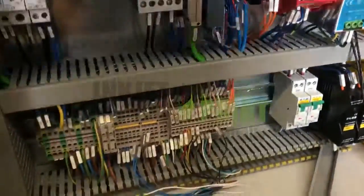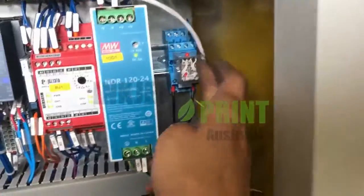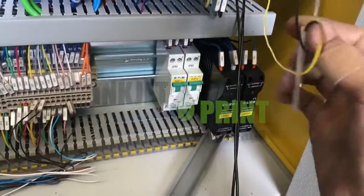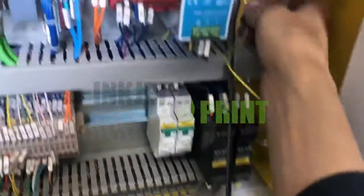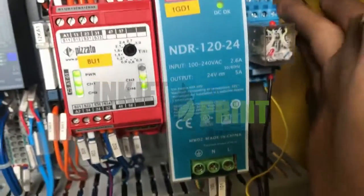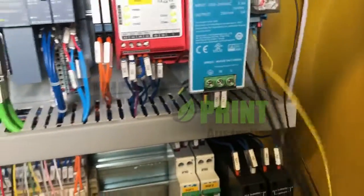In this part we're going to show you how we can find a signal cable in a control box. In the control box we have mounted our 24 volt DC relay here, and we have a comp port coming out of here. There have to be only two wires coming out from the integration cable, which need to go on terminals 41 and 44, which is the normally open dry contact.